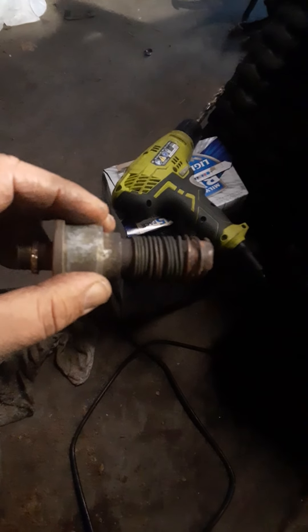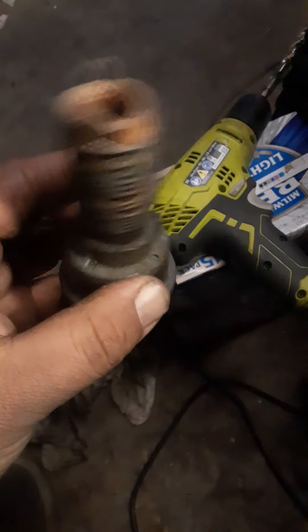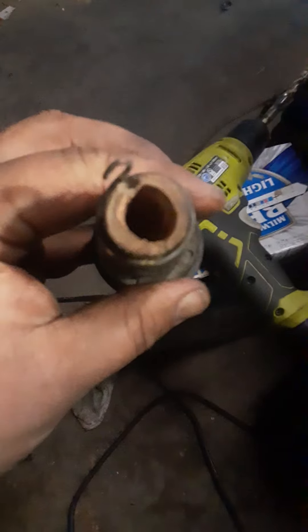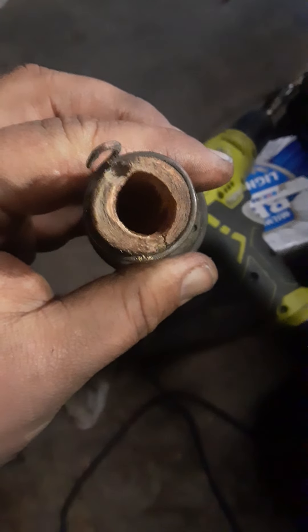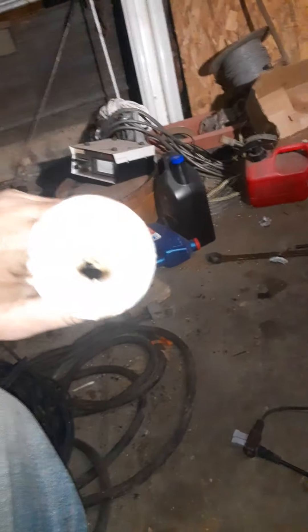Just doing a little work on this Mighty Magnum antenna specialist — the Mighty Magnum. This is a matching coil in the bottom of it. What I did is I took a 7/16th drill bit and honed out what was a wooden dowel in there, because the sawdust from the bit chips definitely came out. You can see it's like wrapped — looks like rings on a tree when you cut it down.